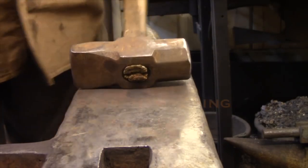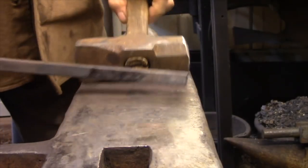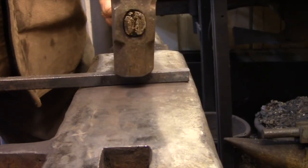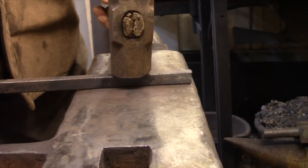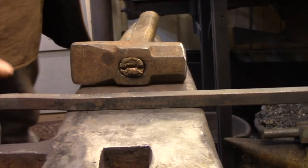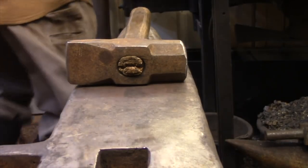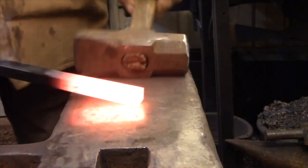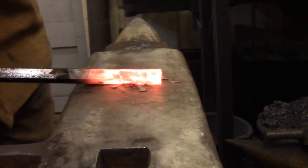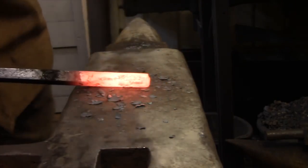In this video I'm going to be covering all the basic hammering techniques that a new smith needs to learn and master. Here's where we all got started — you take a bar, put it dead center in the anvil, and start beating on it. The first thing you have to learn is that working in the center of the anvil with the flat face of the hammer is the most inefficient way of moving metal, so that technique is only used for processes where we either don't want to move any metal at all or are making very slight changes to the shape.